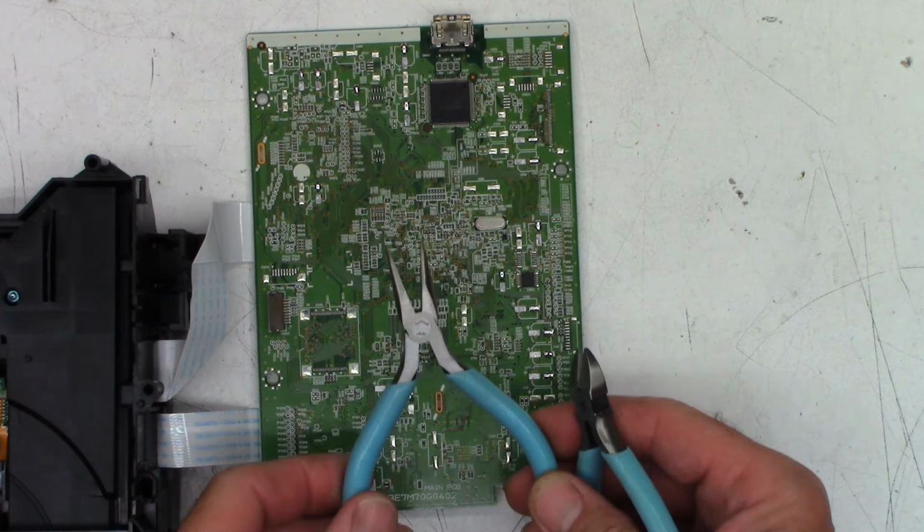And I just want to clean off the surface that the disc actually touches to basically get all the gunk off of it there, because it will actually cause the disc to ride up where the gunk is, and clean where it clamps the disc as well. I should actually move it over here a little bit for you guys. So this is a standard service that I do when I service one of these things. I think this is the first time I've shown this, however. And I'm just going to dry it off.